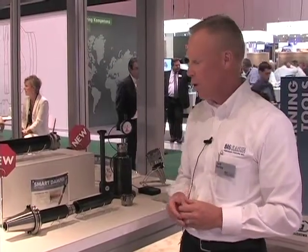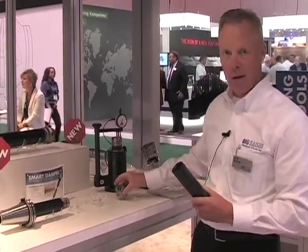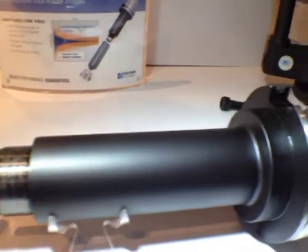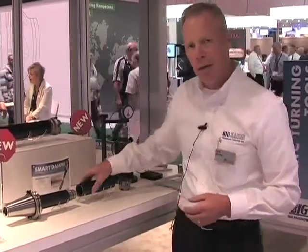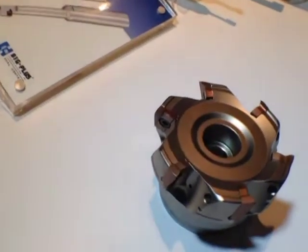Going alongside with the deep hole finish boring, of course, is milling. Taking the same technology we're applying for the finish boring tools, we're applying the Smart Damper technology now to roughing and finish milling operations. The end user can buy a Smart Damper unit to his specifications and configure his own design by a modular system. The two tools screw together and the face milling heads go directly onto it. The obvious advantage, of course, is that all the tools will run with much less vibration, so larger depths of cut — axial and radial — larger feed rates, and larger chip loads can be achieved using the Smart Damper technology.